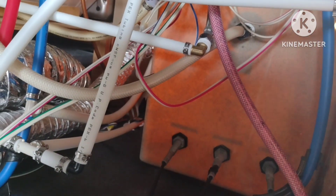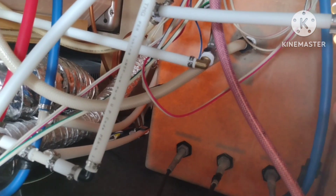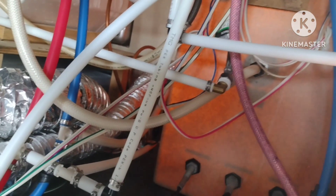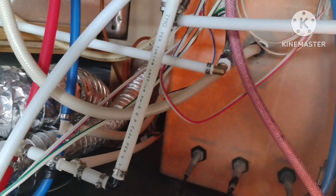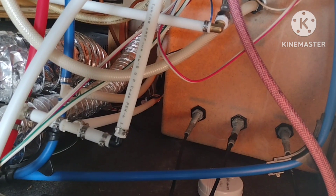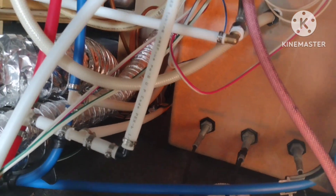I've got everything replaced and I just got home from work. I haven't put this cover back on because these things just spring leaks out of the blue — it could be any random one that's a nylon hose with a PEX clamp. All the other PEX connections have not leaked all week. I've been coming home from work checking it, letting it dry out, checking it for peace of mind. The past two days there hadn't been any water, but today I came home and there were about five drops sitting right here.